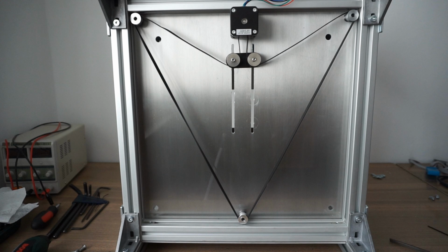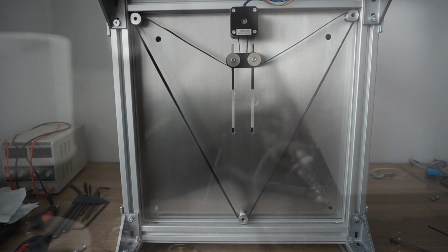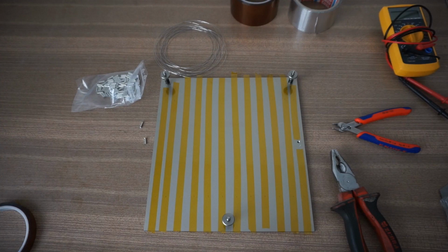Next up, I wanted to upgrade the heatbed, as the old one had some serious problems, like the missing strain reliefs for the cables or its low heating power. So I ripped it off and built another one, which was similar to the old one, but with some major advantages. I'm going to build the heatbed right onto the aluminum print surface, which will help to distribute the heat